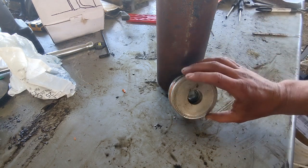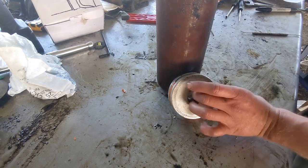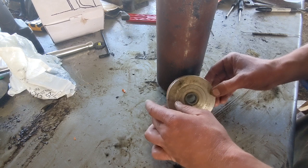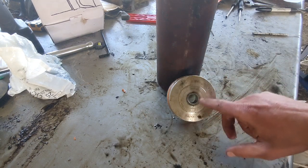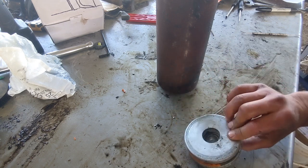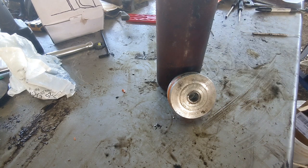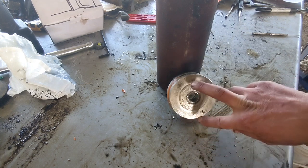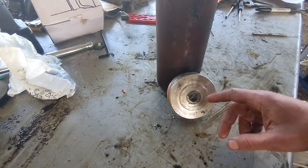But the first thing that you'll need to know is the diameter of this piston, and it's sort of obvious why. Your pressure, this is the backside, right? So the gland end of the cylinder, and this is the rod end of the piston rather. So your pressure comes in here and it's pushing against this surface. It's just the way hydraulics work.